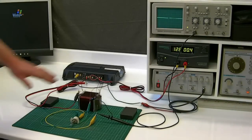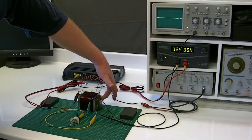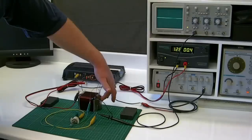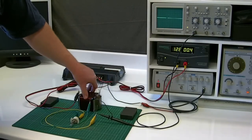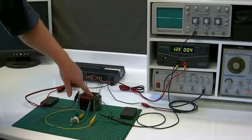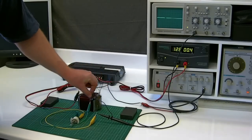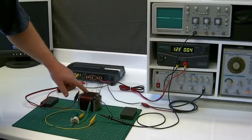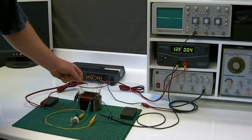The fluxgate magnetometer is here. I have a toroidal core — essentially it's two C-cores, one on this side and one on this side. You would have seen this device before. I've got three coils wound on these formers. There's two formers, one here and one here — one coming down this leg of the C-core, one coming down this leg of the C-core, each one having its own coil on it.